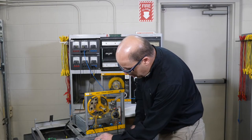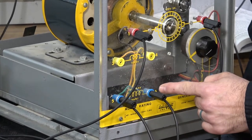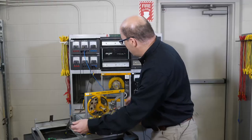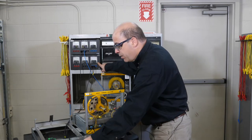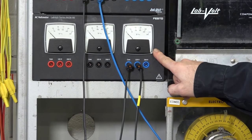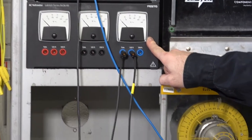Step one will be to connect the armature — terminals 1 and 2 — directly from the power supply to the amp meter, from the amp meter to terminal 1 of your DC machine, and then to complete the circuit terminal 2 goes back to neutral on the power supply. As well, the shunt field, labeled terminals 5 and 6, gets hooked up to the voltmeter.